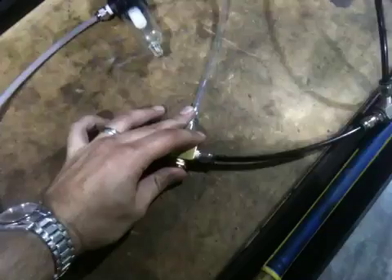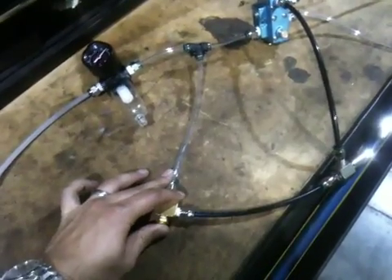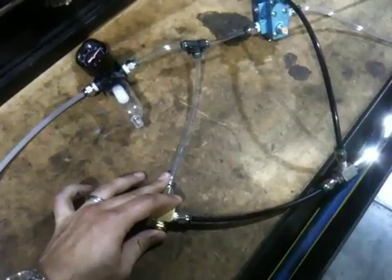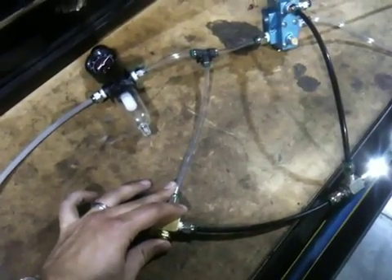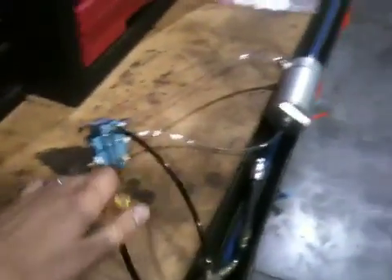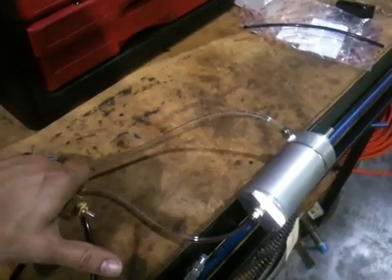The part is going to be placed over the cam roller like so. The customer wants the actuation to be automatic — press and return upon the entry of the part into the press, and then when they pull it out to reset the process. You'll see when I push the button, the process automatically strokes and retracts before I let off the button.